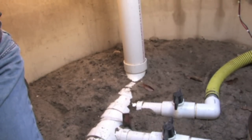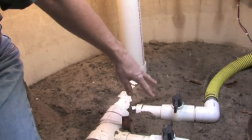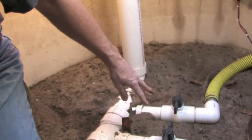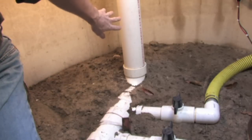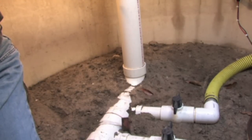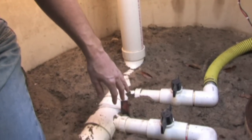And finally, we have a 3-foot riser filled with air. This allows when we turn the power off or turn the water flow off, the excess pressure goes into that air chamber and prevents stress on the pipes.